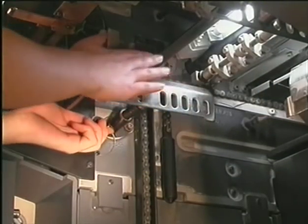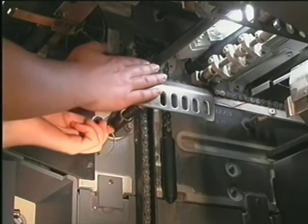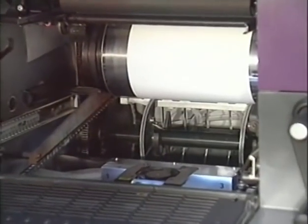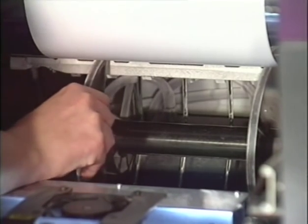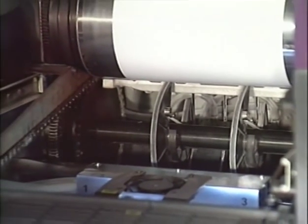You can turn the lateral sheet joggers on the drive side on and off. Please push the sheet jogger against the side frame until it hits the stop and pull the little spring. The guide pulleys are on the chain sprocket shaft and provide for trouble-free transportation of the printed sheets to the delivery. If possible, the guide pulleys should always be positioned in the image-free area of the sheet.